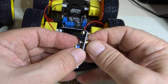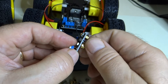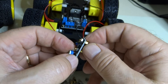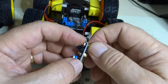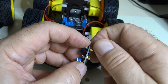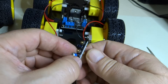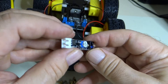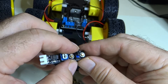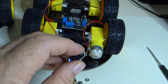You've got to be careful here because you're very, very close to these circuits, close to the LEDs and the sensors. As we tighten these down, we don't want to break the sensors. You can see how the flat edge of the nut fits and kind of sits against the plastic piece of the LEDs. So if that starts turning and putting a lot of pressure on that plastic, it could break the plastic, so we don't want to do that.